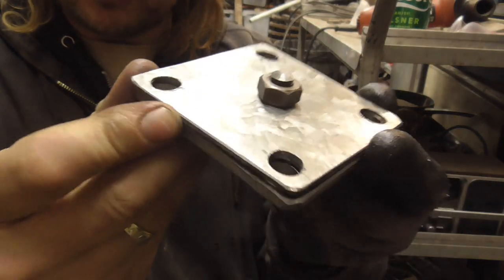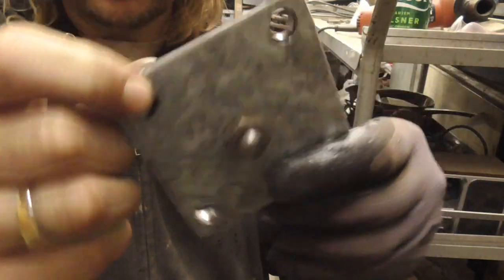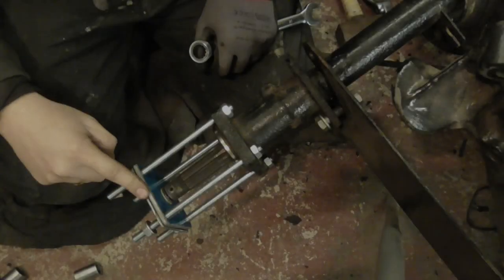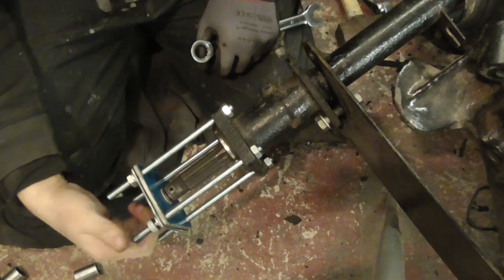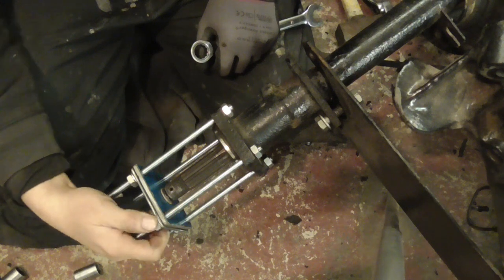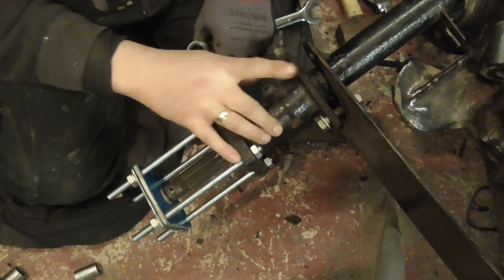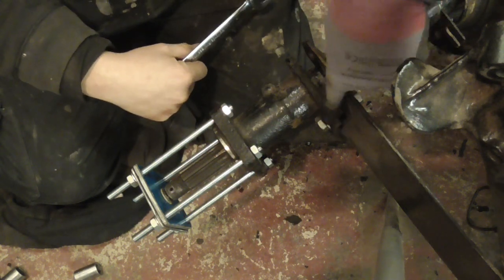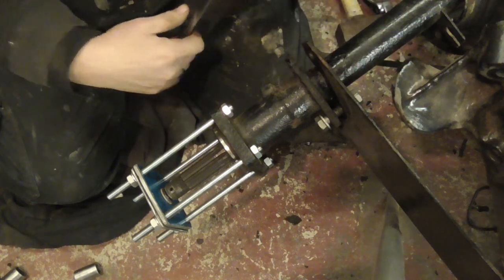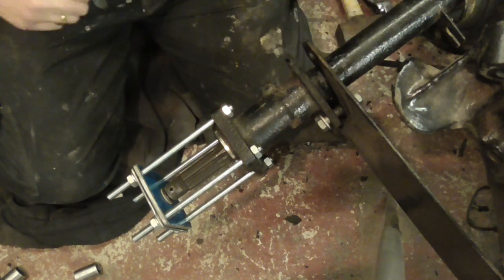This silver one's a little bit bent from when I tried it last, but I can't see me bending 9mm. I've put two plates on and added some washers this time just to help the nuts spin round, and I've put a tiny bit of grease on there as well just to reduce friction. The axle tube was rattling around and knocking against the spring plate, so I've put it back into place on the spring plate and put one of the bolts back in to stop anything from spinning. I've nipped up the nuts at the back — I'll give it a try.